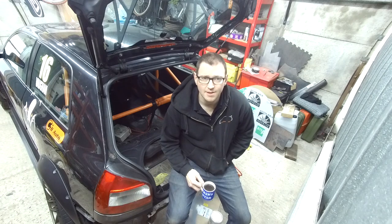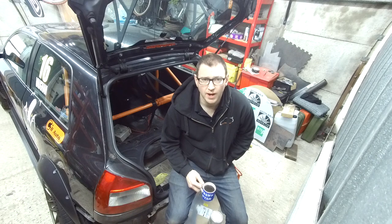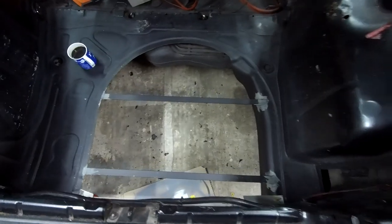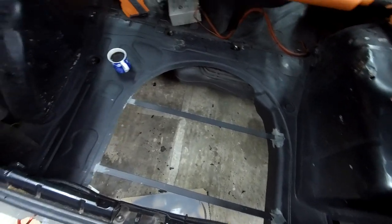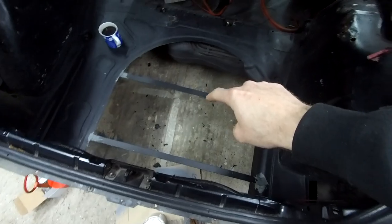It is Wednesday morning. The weather is absolutely horrendous, which is great because I planned on doing some painting today. So we're currently inside with the door shut. We've got some cross-members in, they're all painted. I've given the floor a coat of etch primer and a coat of matte black just to get it black. I'm now going to throw some body colour in here before we drill and rivet the sheet and get that in.